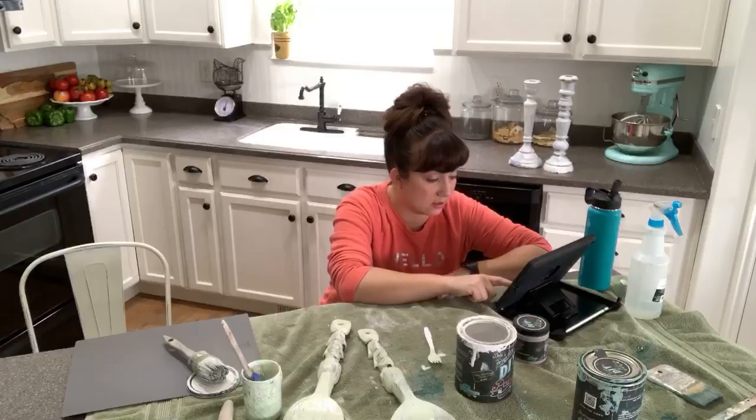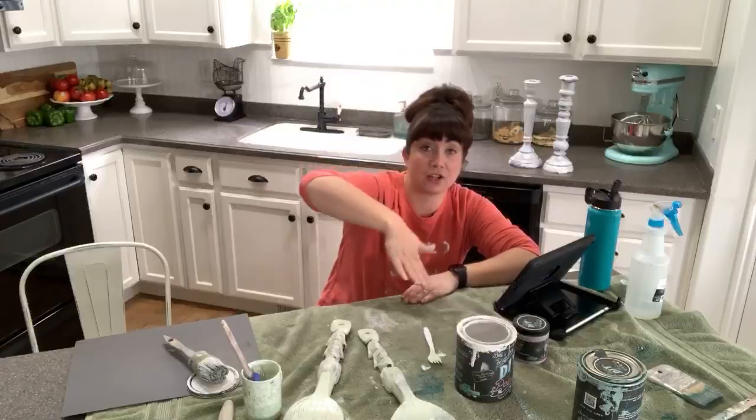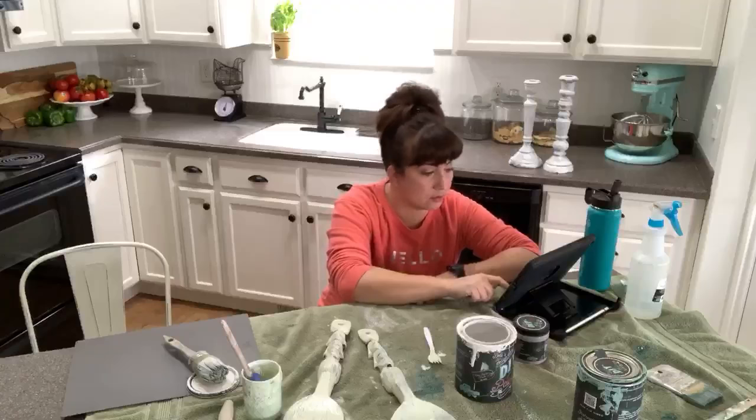What can you do if the milk paint chipped in large sections? Sand that section down and then spray a coat of shellac - it's possible there's something causing it not to adhere. Let it dry completely after you've sanded that area smooth, which should seal in whatever was causing the resist. Then come back with milk paint with bond on it and paint an entire section. Feather it in to where the other paint is so it doesn't look splotchy.